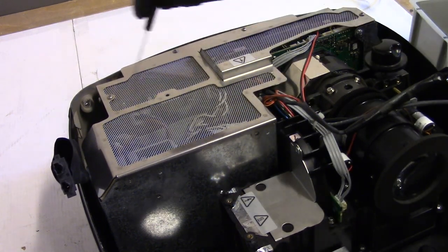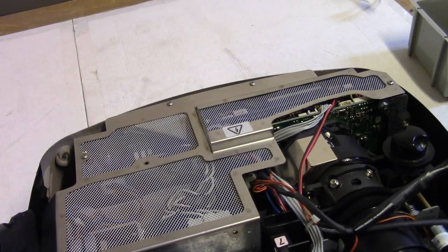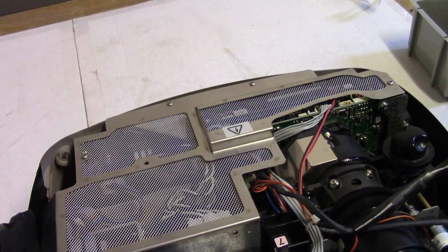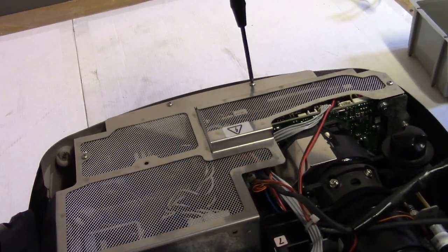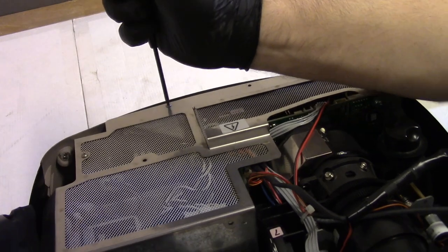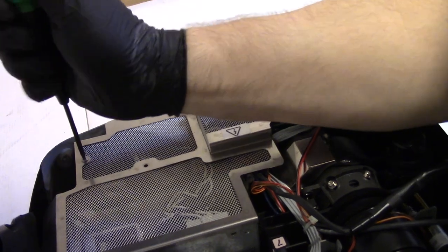Putting the flathead between the pin and the teeth, but they're a little too tight, so instead it just kind of breaks that little pin out. But that means I can just use a normal Torx. I don't need a fancy security driver Torx. I can just use a normal Torx. Sometimes if these are not super tight, that slotted driver is enough to get them moving.